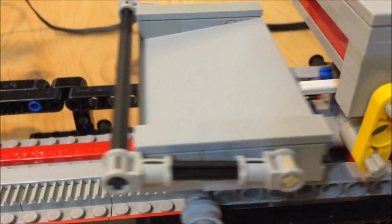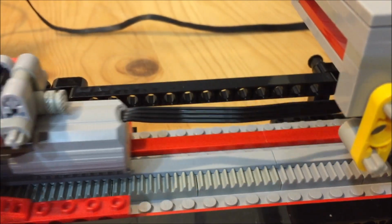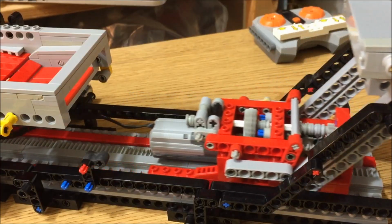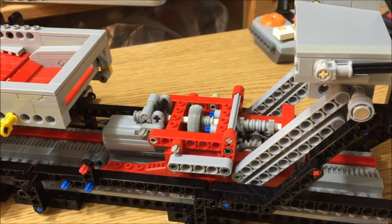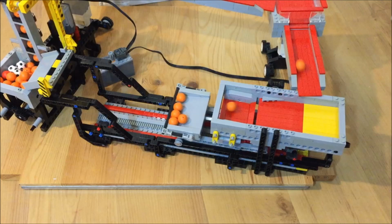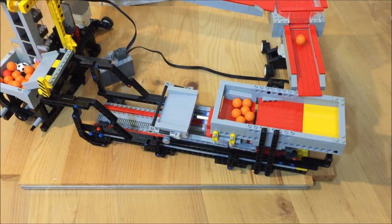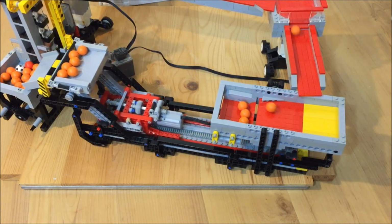Ultimately, I don't like that this reversing mechanism needs a rubber band to prevent the transmission from dead centering. But if it proves reliable, I may try to think of an alternative for a future version 2. The dog shifting the transmission shaft also relies on bushing friction to remain in place. Using tighter old bushings makes this less bad, but I don't know of any other way to build this part. As usual, we shall see what happens on the reliability front.